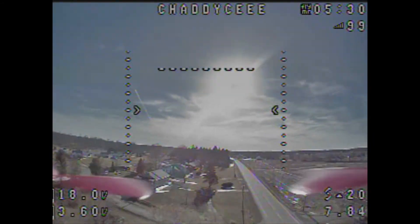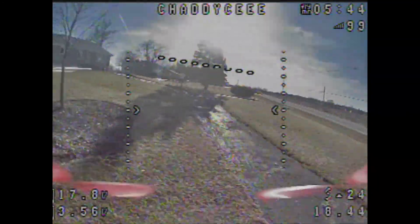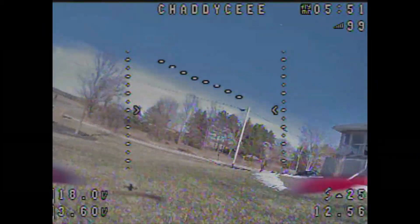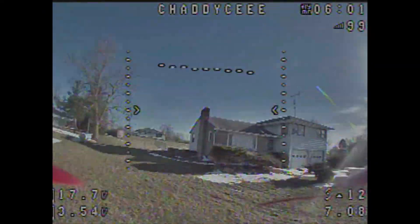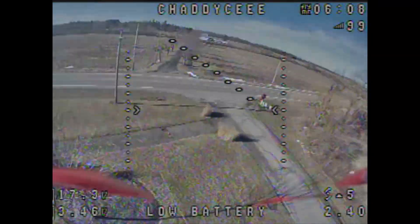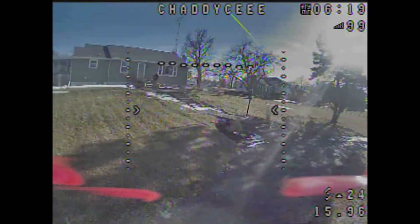There I am standing down on my porch flying. I just wanted to throw that out there - these antennas are really good price, they're like 17 to 20 bucks. Definitely worth checking out, especially for people here in the Midwest and areas where we have tree lines and need a little extra punch through those trees and up and down hills. It definitely works. I've actually got it permanently mounted on my goggle now with some dual lock right in the center, so it's basically just pointing directly wherever I put my head. I'm still using the X-Air patch for now, but I think I might just end up going with the three-turn and five-turn when it's all said and done. More testing to come on that. See you guys later.